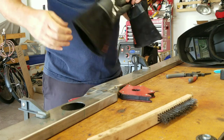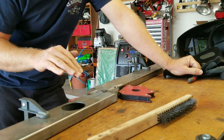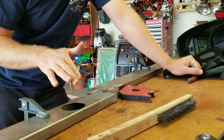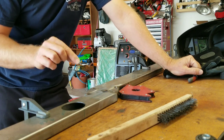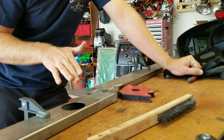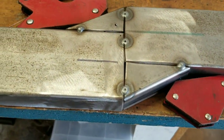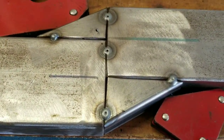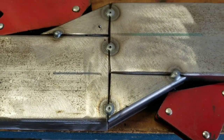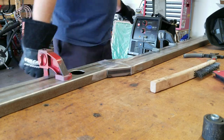Lesson learned: on my other frame rail I went around a little too fast, got the metal too hot, and it wants to pull up a little bit. The trick is to go around slowly, get it tacked up on both sides, let it cool down in between before you come back and finish weld. When you do finish weld, only run small amounts at a time. Don't get in a hurry — if you do, things end up moving on you. I'm going to let that cool down for five or so minutes, unclamp it, flip it over, and tack the other side.